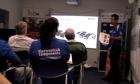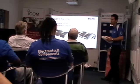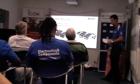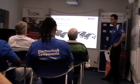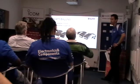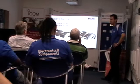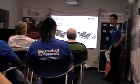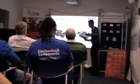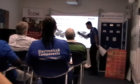Do you use them really? I was just putting it on you because you've installed a few systems. We have installed a system with Cat5. We've had other issues, as in power issues, because the place actually has three phase, and different monitors compared to the DVRs are on different phases. And you get rolling across your screen. That's the only issue, but the actual Cat5 itself works fine. Once again, there'll be different connections at the camera and the DVR. I'll explain a little bit about what you can use with these in a moment.